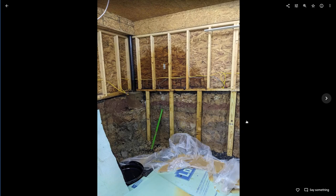On the weekend I went down and came across a mysterious wet wall — I didn't know why it was wet or what was going on. We knew that the hose clamp that came with the sump pump was just really terrible, not holding on well, so it was on my to-do list to change. Then I went and looked into the crock, pulled up on the float to make it pump out, and it squirted massive amounts of water all on my face — I realized immediately what was going on. I replaced the hose clamp with a proper one and ended up doing some work to make sure the water drained properly out to the French drains, and after that all was fine.